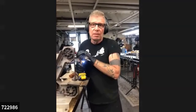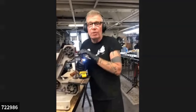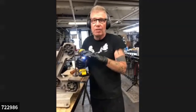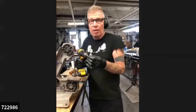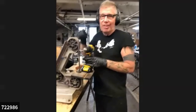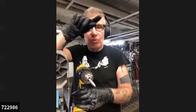Jerry has also asked, do you round the corner on the tool edge? I'm going to get right to that now. Yes, that's a very important part that distinguishes it as a tool that will work well for repoussé. It looks like a punch right now, but you don't want it to act like a punch. You don't want a sharp, scissor-sharp straight edge. Instead, the edge is ever so slightly rounded.